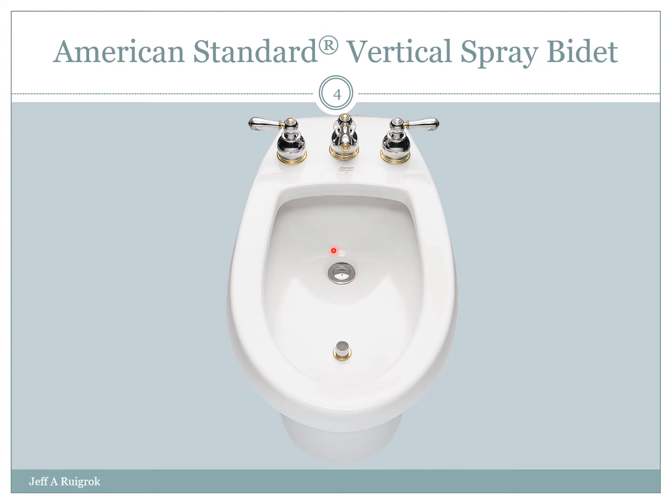As I mentioned, this is much like a hand wash basin but it's a butt wash basin. This is the PO — the fixture outlet pipe — here in the bottom, and this is the mechanical one. You pull up on the rod hidden behind the fixture here, pull it up and it closes; push it down and this would open for draining. So you can actually fill it the same as you might fill it to shave or wash your face — you can fill this to wash your butt.